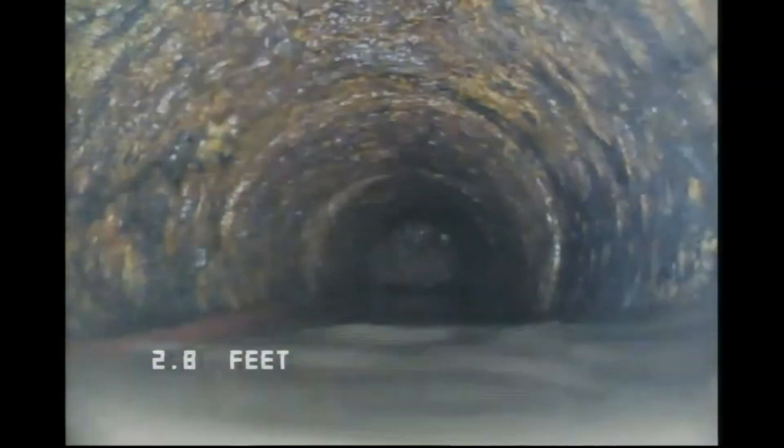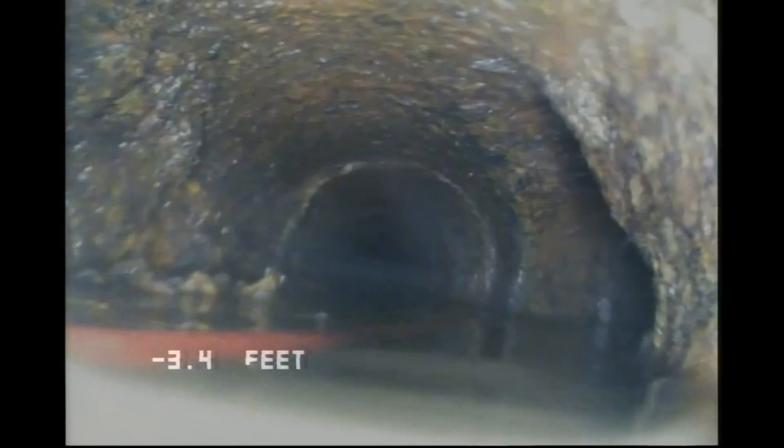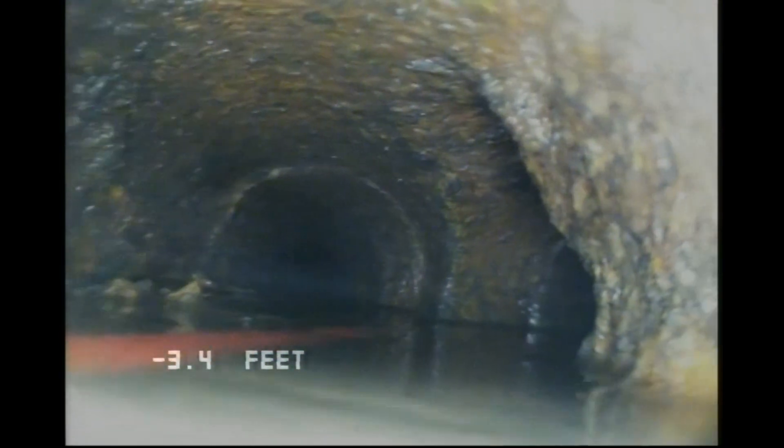I believe this is the underside of a toilet or a bathroom. I'm going to flush the toilet and see what happens. Toilet got flushed - I'm pulling back because the water is rising in the pipe before it gets a chance to drain out. Pull back and see what I'm looking at. Toilet flush - we're clear. This isn't really a problem; this pipe itself is doing pretty good. It's the main serving the whole house that I'm concerned about. There are a bunch of spots I'm going through and working at descaling. I'm going to pull out of that Y and continue on to the next.